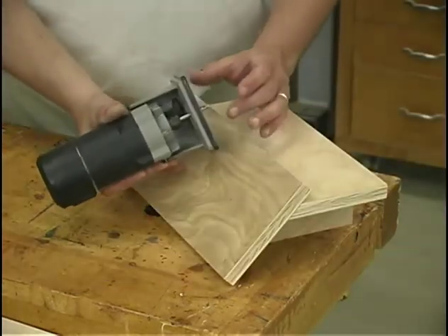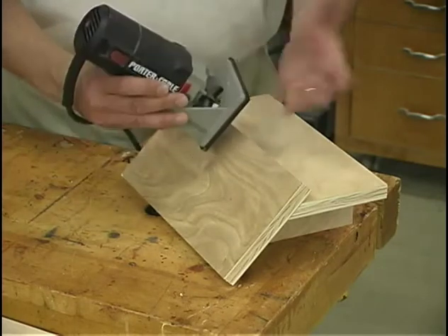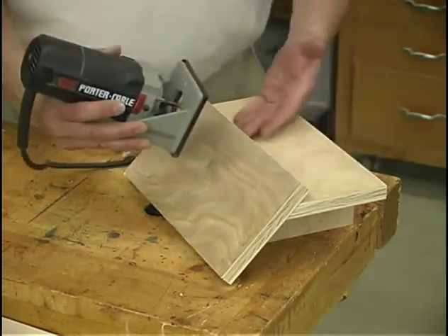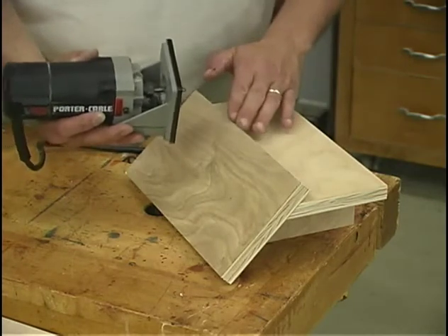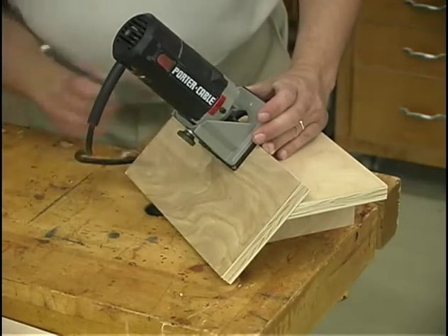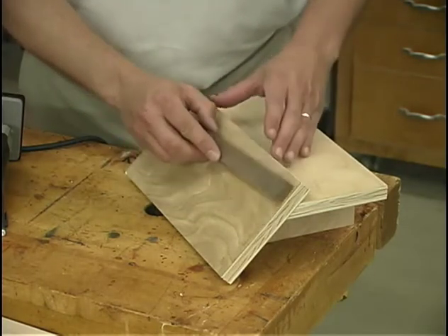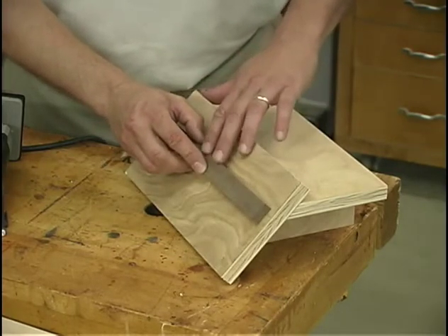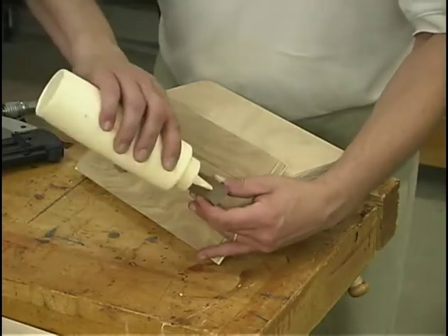Most of the time when I use splines to reinforce a miter joint they're a quarter inch thick, so it makes sense to use a quarter inch diameter router bit — this one happens to be a carbide spiral bit but it really doesn't matter. We want the router to feed along so that it's parallel to the edge or to the bevel that we cut on the end of our board. We also want the router bit to just touch this edge of our tool support. I'll lay my router on here and create a mark to establish the top position of where we want our fence to be located. If you're using a bigger router it's probably going to be offset further down, so it's just a matter of calculating that offset before we attach the tool guide.